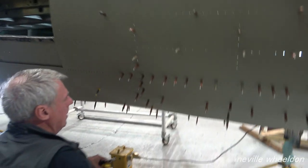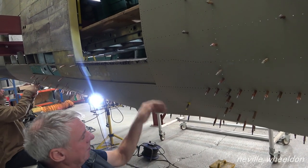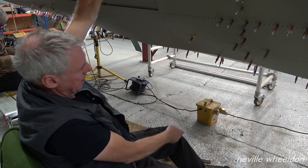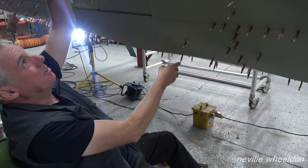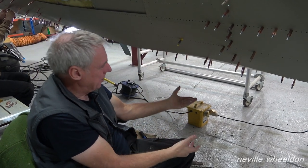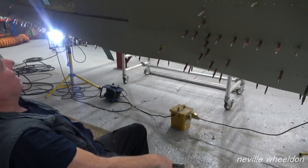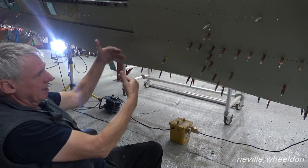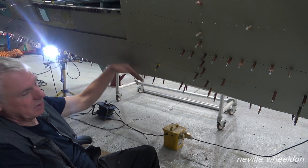This comes to the odd bit, does it, where you're pinning three skins together? Yes. When the roof collapsed on this, there was a trestle underneath here. The roof girder hit the top. The trestle underneath here, obviously equal and opposite reaction, Newton's law. The stanchion came down the top. This, for a nanosecond, tried to hold its own, but that gave way as well, so all this was pushed in as well as the top being pushed down. So we haven't replaced every single piece of structure in here, so that moment is still in here, where just around here there's a little bit of distortion that we, by putting the new skin on it, are reprofiling.